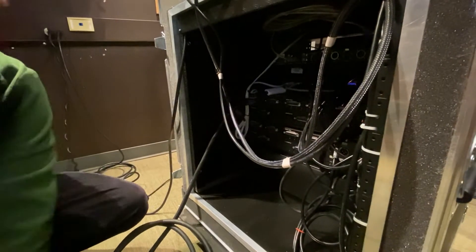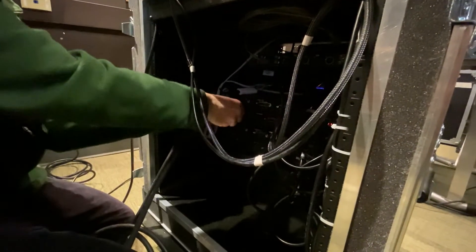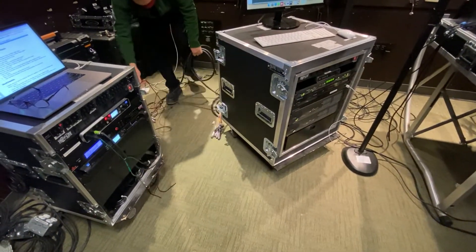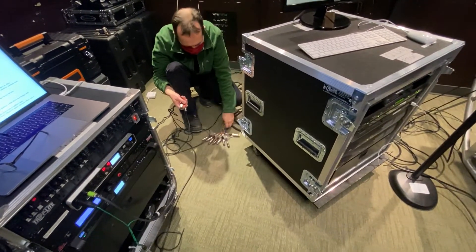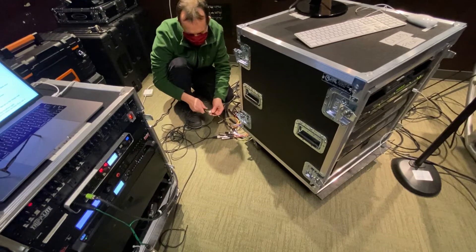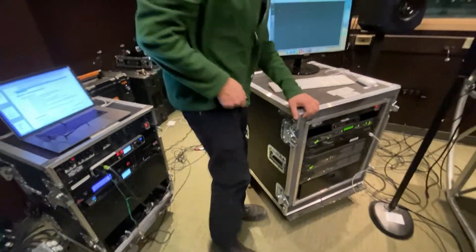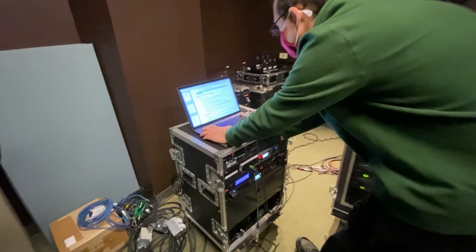I'm going to find that same first interface analog output — pretty simple, maybe screwed in, maybe not, just make sure you don't break it. Here are my two XLRs that are feeding in and out of Smaart — my transfer curve. I want to go in and out. I know my resistor color: brown is one. So I'm going to go into brown on this one and out of brown on this one. The numbers are a bit weird — this one says 17, which would be number one if the snake were used for something different. So I should have a loop here.